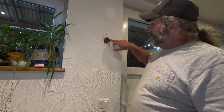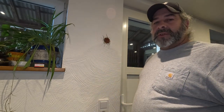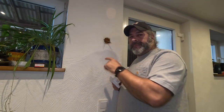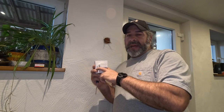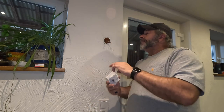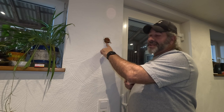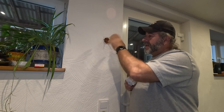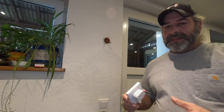What we're going to do is use the black for the neutral and the gray for the signal to open the valve. So I have to take this little plate off and get everything set up. Looking at the metal plate and then the back of the thermostat, the thermostat has the screws at 3 o'clock and 9 o'clock, and I have my screws at 12 and 6. So we're going to have to clock this box 90 degrees in order to use this.